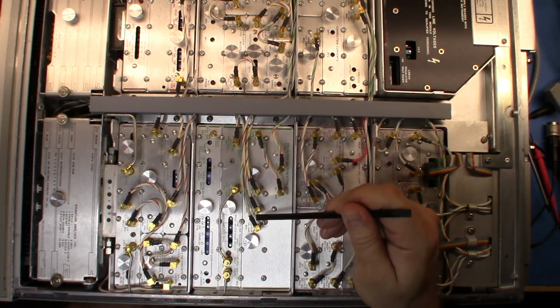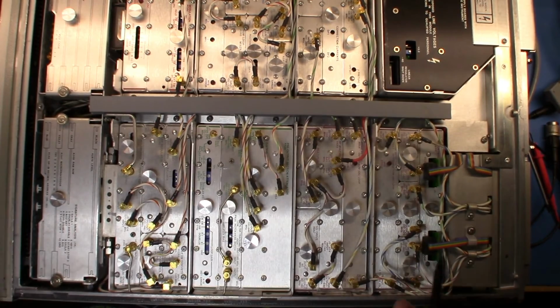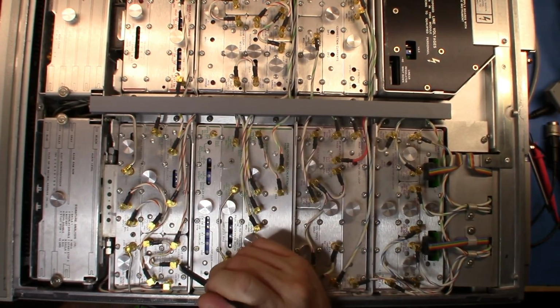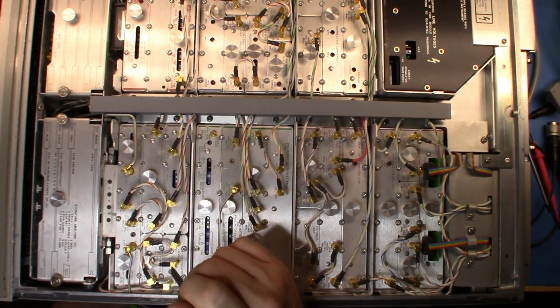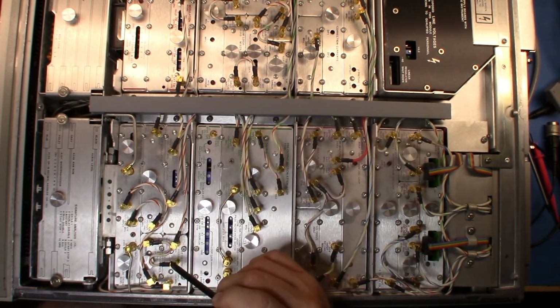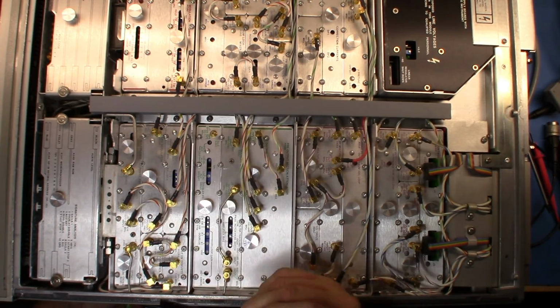And so that 520.1 to 640 is the upper end of the primary VCO band by the look of it. And that's being fed into this down converter here, which is then converting that down to 1 to 120 megahertz from 520 to 640. So it's taking basically 520 megahertz off this thing here. So there will be a 520 megahertz input, and you can see that is this guy right here.